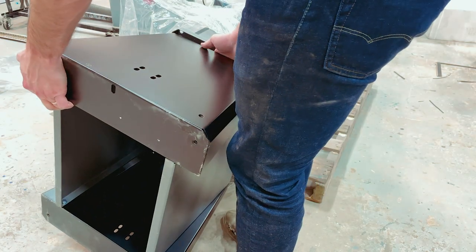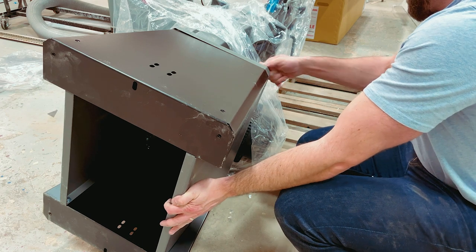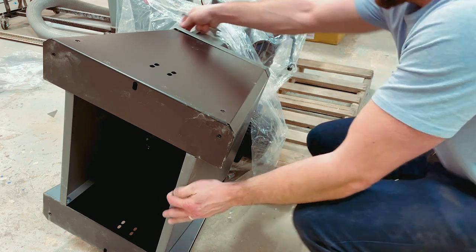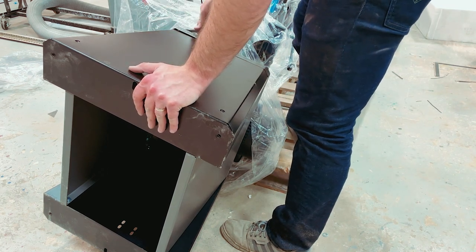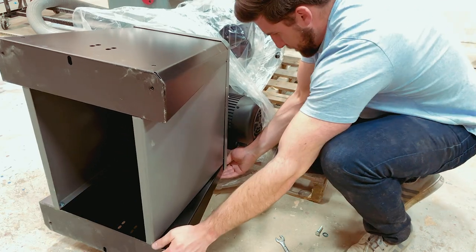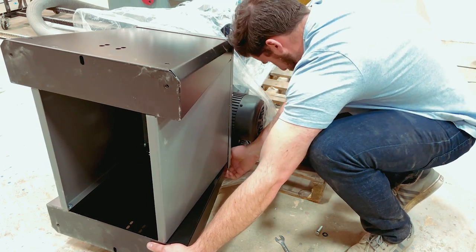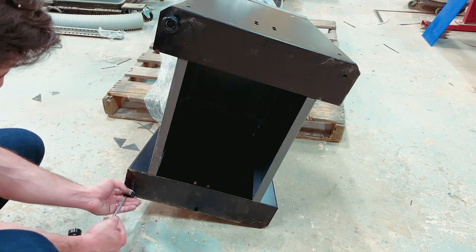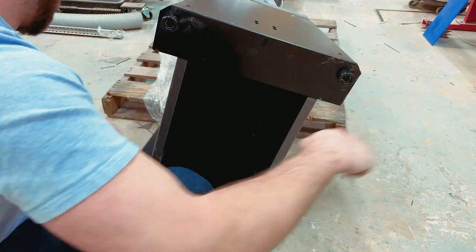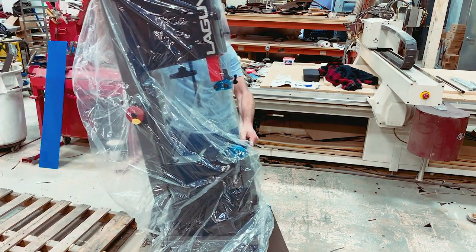Now to get the bottom on, you're not going to lift the saw on top of it, so you kind of have to prop it up. I've put it on a pallet, but it would have been helpful to have it on something bigger and to maybe block up the motor a bit to get it even. This did work though, and it wasn't too bad. So I got it kind of largely set on there, and then when I get it upright I will go in and tighten all these bolts the rest of the way and make sure everything's nice and sturdy. There was a little playing around to make sure everything went in straight, but we got it figured out. Getting the feet on, and then it'll be time to stand this thing up — which puts us about 40% of the way through the entire process.